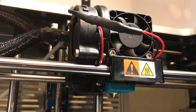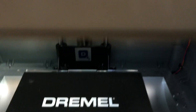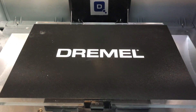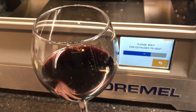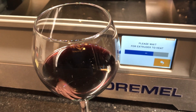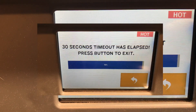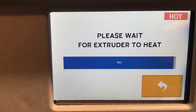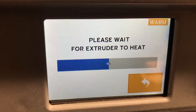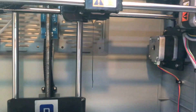Let's see how she prints. Everything powered up, everything went home — pretty happy with that. Let me load some filament. Anytime you change something like this, it's really best to re-level and then do a test print. It looks like we're stuck at 98% and it's timed out on me twice. I'm going to remove the blue silicone jacket and try the black one, just in case. Alright, I got it to load — filament's coming out. Let's build.